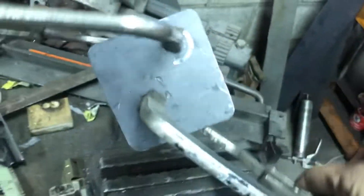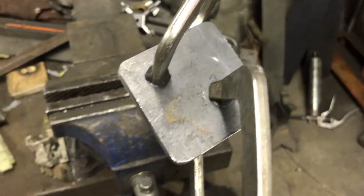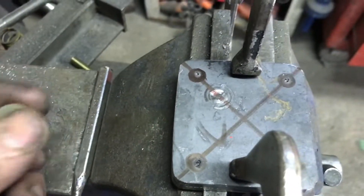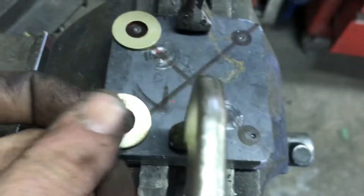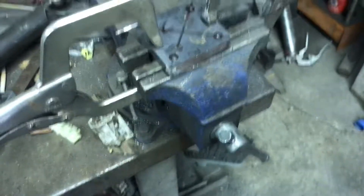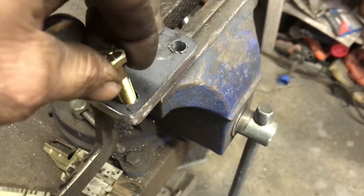Got that made up, got all the sides ground down nice and clean. We're gonna mark it out, make four holes, and then we'll be able to go weld it in. Got that all ground down, found the center of it. Using three-eighth bolts — I put four washers here like that, put a little center punch in it. Going to the drill press to drill through all four pieces at one time so they all look the same.